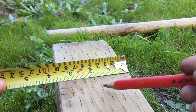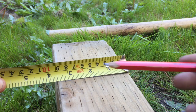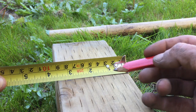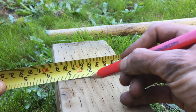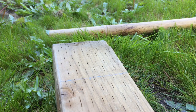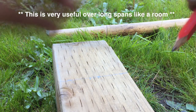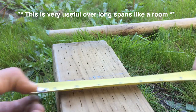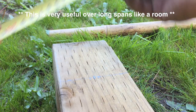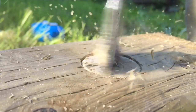Here's a cool trick for finding the center of something without doing any math. This is a four-by-four — which is actually three and a half inches, that's just how lumber works. So instead of calculating, go to something that looks very close to center, like two inches, then measure two inches from the other side, and the center of those two marks is going to be center. You can kind of just eyeball it — I'm going to be within a very small fraction of an inch. One and three-quarters — boom.